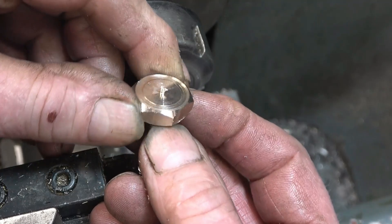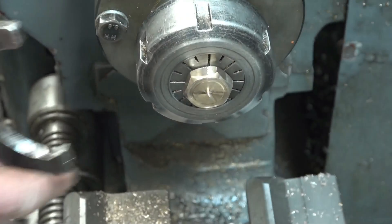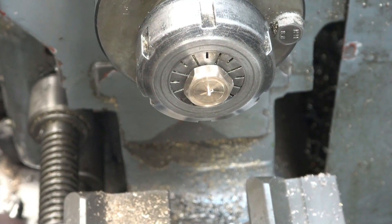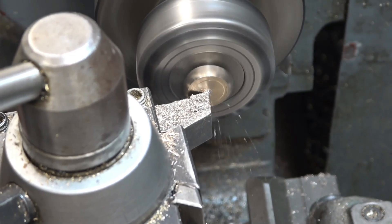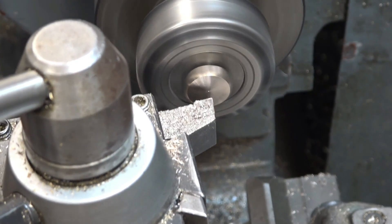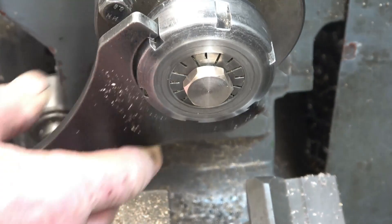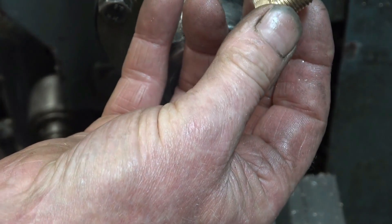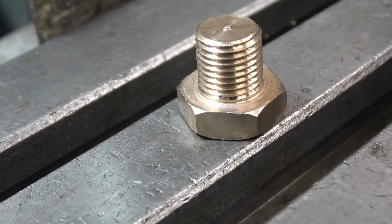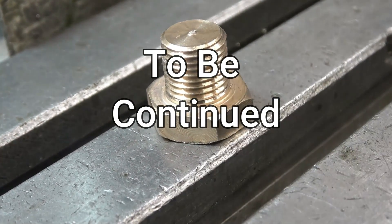It's left a little pip on there unfortunately, which is not the end of the world. I've put it in a smaller collet and I've decided to face the end of the hex head off just to make it nice — I'm not really happy the way it turned out. A little nip on there so we're not damaging the threads. 1000 RPM, a really fine cut there. That's better. Looks like somebody actually cares. So that's one of the finished articles — I'll run a quarter parallel tap to clean the threads up in the socket it goes into. It is slightly oversize so it should screw in quite nicely. There'll be a copper washer on there as well.